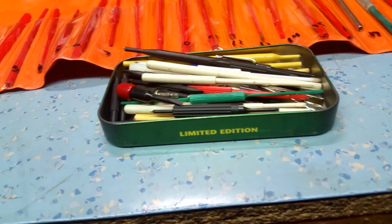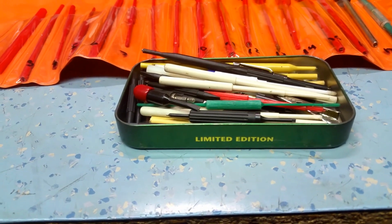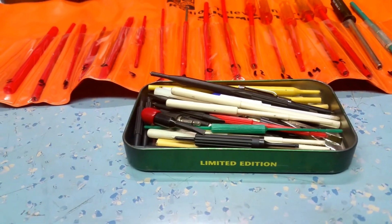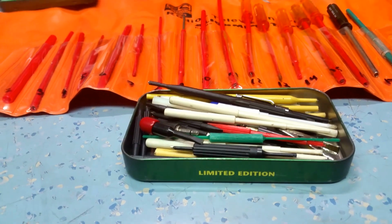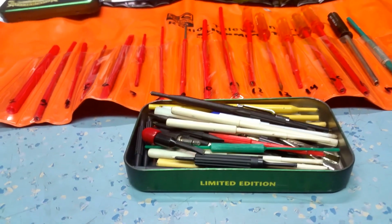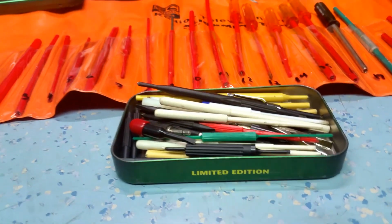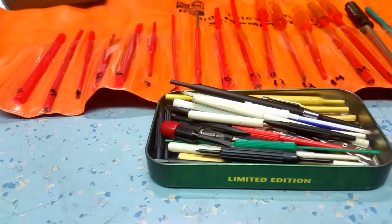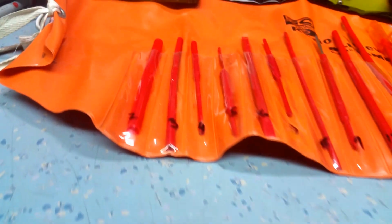So what you're supposed to do, certainly on the older sets with the wax sealing, is soften the wax. That's usually achieved, especially on valve radios, by just leaving them on for an hour or so. The wax softens. Or you could use a low level heat gun just to soften the wax up. And once the cores are moving, all you need is the appropriate tool for the particular transformer.